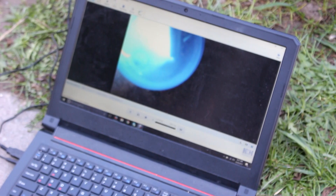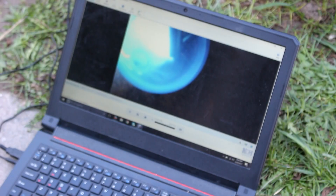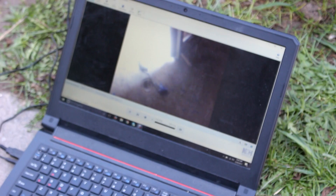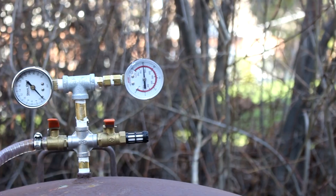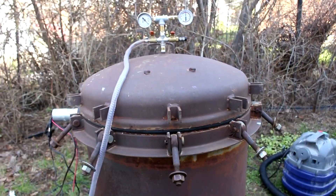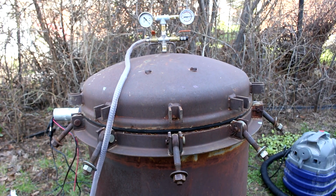I was watching this, and as the balloon got really, really big and the pressure got really low, the balloon actually stopped floating. That makes sense because now the balloon is under more pressure than the outside air, so it's no longer displacing enough air to counteract its own weight. It should burst any moment now. It seems to burst at about the equivalent of 50,000 feet. My camera is still in place so I think we caught all that. We're back under vacuum. Let's pull off these bolts — under vacuum the lid is being pushed on tighter than the bolts were forcing it. I just have to release the pressure back into the chamber and take the lid off to recover my camera.